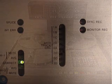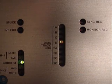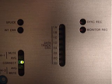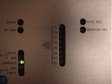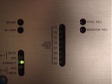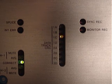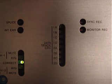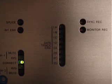The digital audio is recorded onto the tape using eight digital heads. The flashing orange lights indicate a cyclic redundancy check. The recorder can have many errors before this affects the sound signal. To the left you can see a green and orange LED saying 'correct.' If the error correction is too high the lights will go to orange. If it becomes unreadable, the muting circuit will kick in and the sound will stop being replayed.